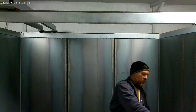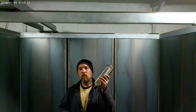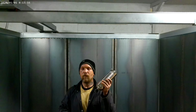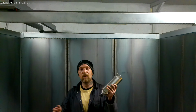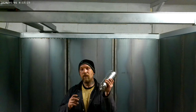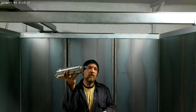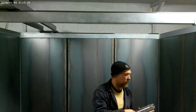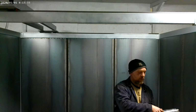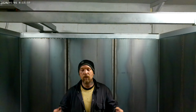Alright, the next one is the spindle. Oh, Jesus. Alright, so it's a 2.2 kilowatt water cooled spindle. This will be doing all the cutting of the prints, basically, hence hybrid. So material goes down, a bit thicker than it should be, and then this will come across and bring it to where it needs to be. Hopefully, you can put some more detail into it, especially when it comes to a layout mold. Get plenty of fine detail in there then, or models.